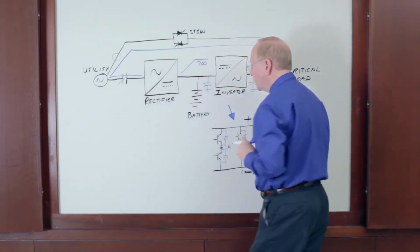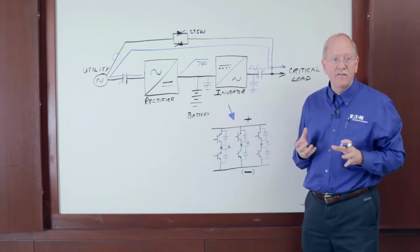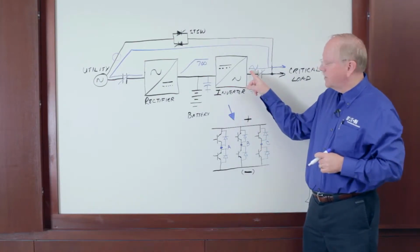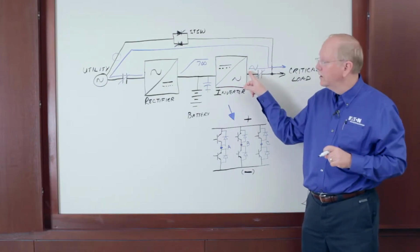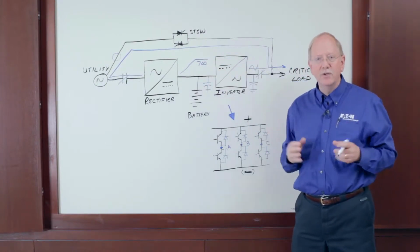So with closed contactors, I have voltage here, and I have voltage here. The rectifier and inverter are suspended, but the inverter is still generating its gate commands for its main power transistors. It's not actually firing those transistors, so it's not using any power. But the gate command signals are already in sync with the output here, so I don't have to wait for sync when I flash the inverter on. But what about this rectifier that has to charge these capacitors over 30 seconds from 0 to 700 volts? How do we do that?